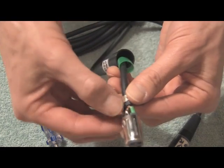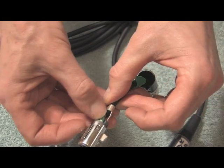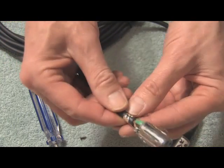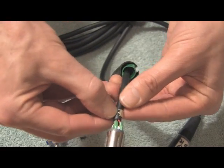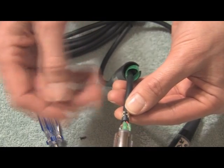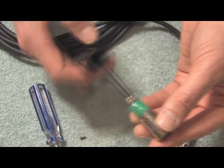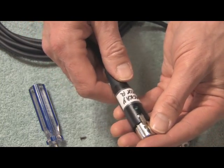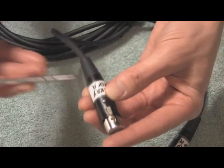You can see the terminals here. Again, we have pin 1, which is our bare wire; pin 2, which is our positive; and pin 3, which is our negative. This one does not require an external strain relief because you have one built in. When these come in raw form, the clamps are going to be opened up. You solder your connections, crimp that closed, make your solder connections, slide that piece in, and put the connector back together. These are engineered very nicely, so they fit together easily and it just slides right in. Then reinsert the connector block screw.